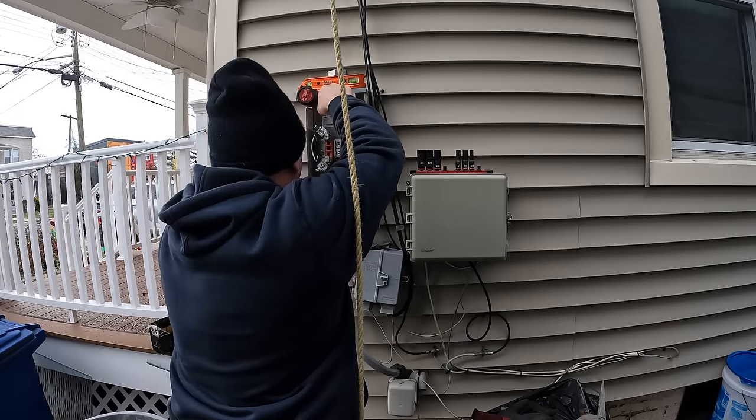And so once I get my straps on near the enclosure, now I'm able to take my channel locks and start making it nice and tight. I put the duct seal around the top. That's how we do it here in the Northeast. I know you can't do that in Texas. I know you cannot do that in California, Washington, and Oregon. But here in New Jersey, Massachusetts, Maine, this is how we do it.